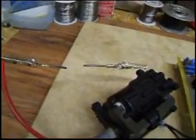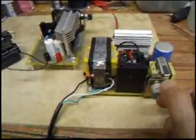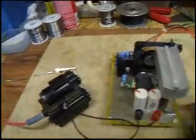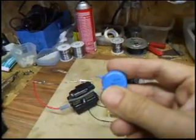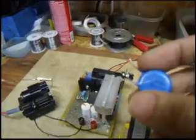It's only about an inch long — and it just went out, probably because I breathed on it. So I'm going to turn the power down and wire a capacitor across the terminals. It's a 1000 picofarad capacitor rated at 15 kilovolts.